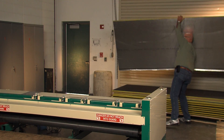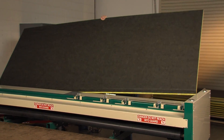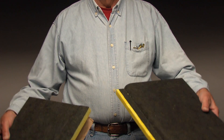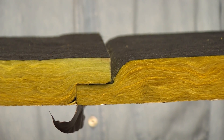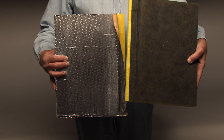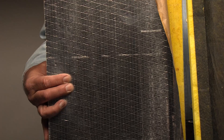For those of you who have never worked with fiberglass duct board, ducts are fabricated from 4-foot by 10-foot sheets of fiberglass board. Each board has factory formed male and female shiplap edges, engineered to provide a method for joining duct joints together. One side of the board has an aluminum vapor retarder facing, reinforced with fiberglass fabric adhered to the surface.